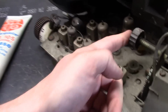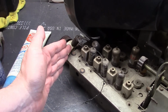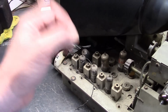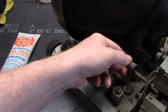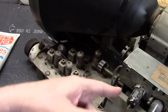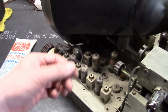Oh, and then there's this. Normally the tuner would be mounted up front, and there'd be some sort of access point so you could feed in a tool to tweak the local oscillator slug for each channel. In this set, they do it with this gizmo. So this you push in, and it will engage with something inside here, and you can adjust, I presume, a slug or a variable cap. But normally the spring kicks it out so it's not engaged with anything. Fine tuning, unfortunately, broke.